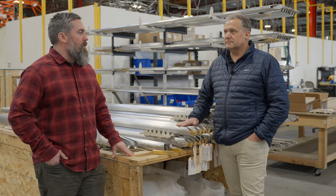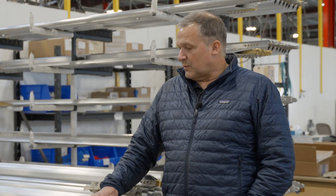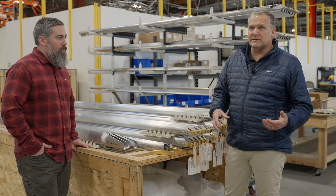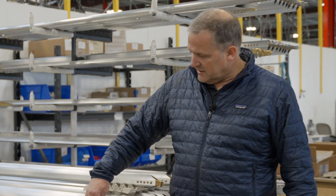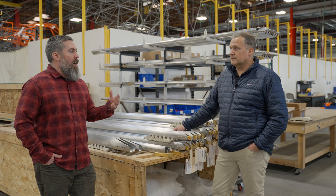Could we talk about manufacturing the products here? We've just recently bought a new machine that will be used to manufacture these. The raw material we get is an extrusion length. Previously we used a vertical CNC mill to do the milling — they're very long, take a lot of room, and our demand is pretty high. So we just purchased a dedicated CNC router with a big bed that's going to do aluminum struts only. It will profile all of them, drill and ream the rivet holes — that's all it'll do.